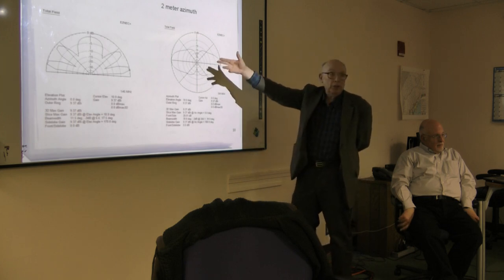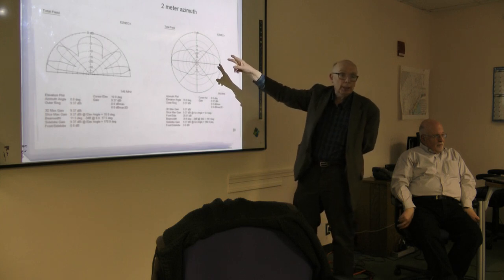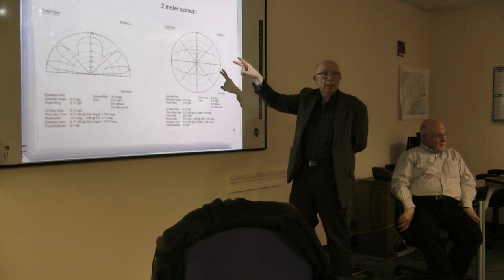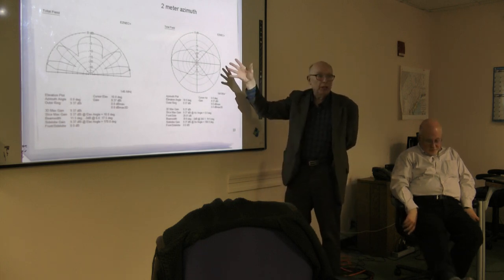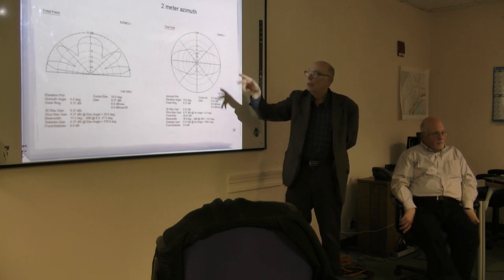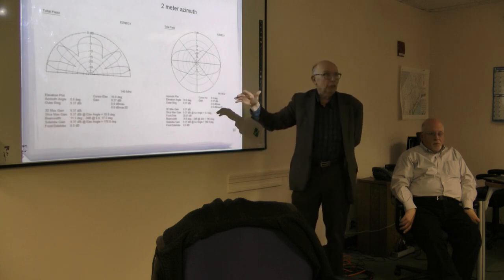There may be some gain, and it has entirely to do not so much with the antenna itself, but how the antenna is reacting with the ground underneath. The three most important factors on how an antenna works actually are location, location, and location. Height above ground and the characteristics of the ground